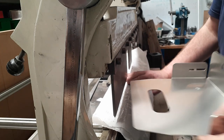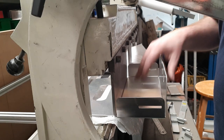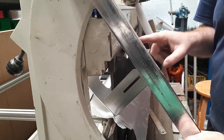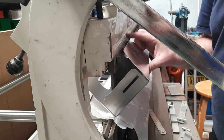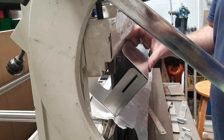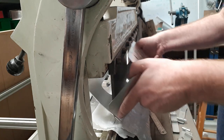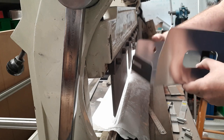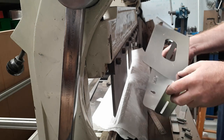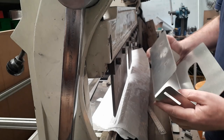Got the fence set up correctly for this one. Now we can pop this in and just fold this last section up. There we go — as I go forward like that, bring it up. Now, had this been the taller section, it would have carried on and caught on the frame up here — you can see past there it would have caught on the frame. If I hadn't done the bends in the right order, it would have bent backwards and outwards, deforming the part. By getting the correct bend order, I managed to fold it to the required shape without hitting any of the frame.